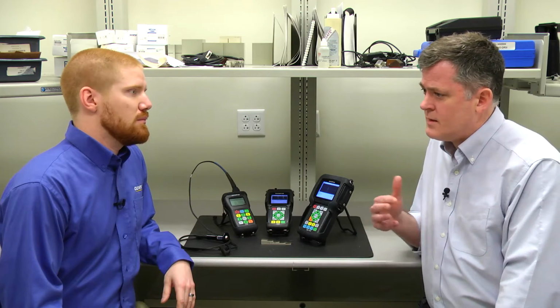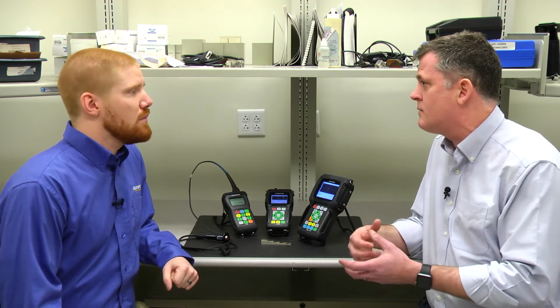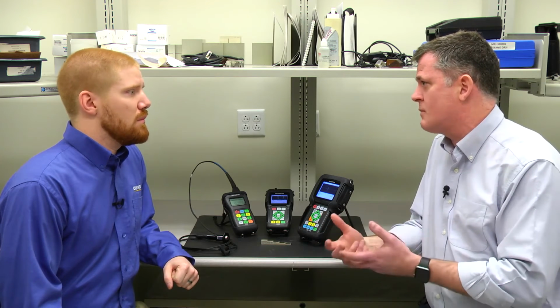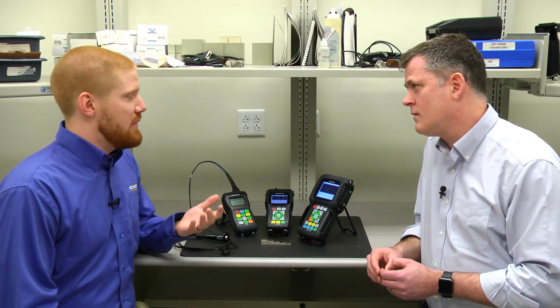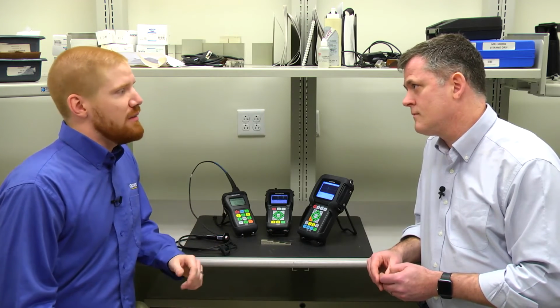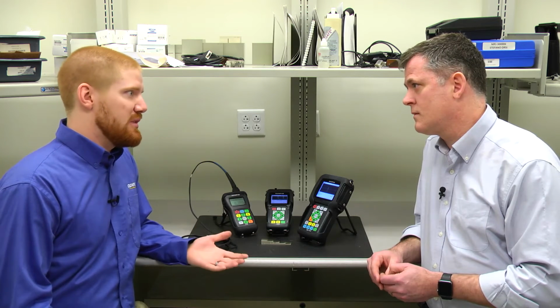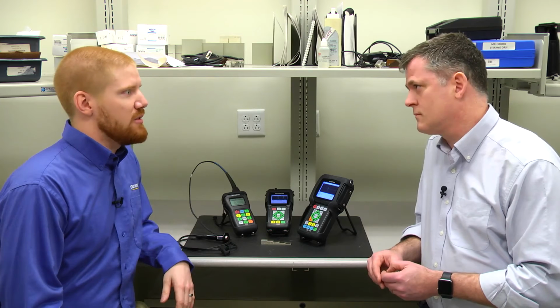How are these two types of testing different? So when you're testing for precision versus corrosion, how is that process different? For dual elements, because they're typically always used for metal applications, they have a center pin that auto-recognizes when they're plugged into a gauge. So the instrument can pull up the optimized setup for that transducer, also the V-path correction. Because we're sending sound at an angle, the true metal thickness is straight in and straight out, which is what we do with single elements with precision. Right. So because of that angular sound path, the dual elements and the corrosion gauges have a V-path correction to correct for that angular sound path.